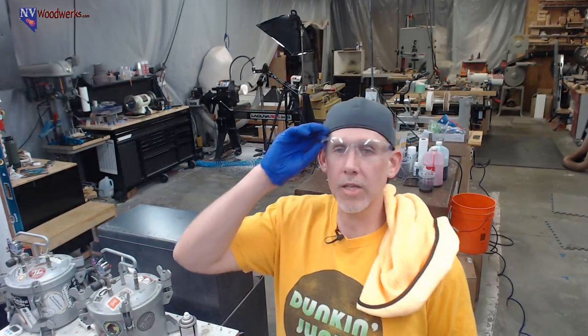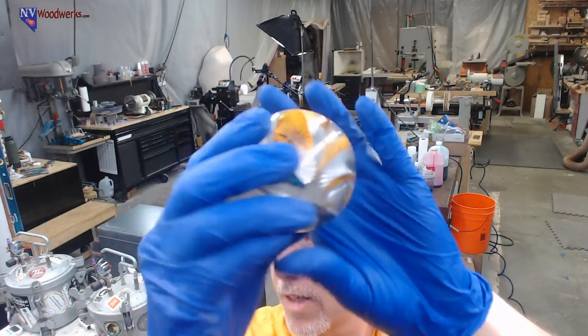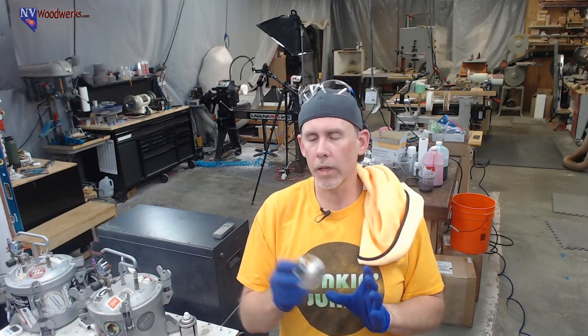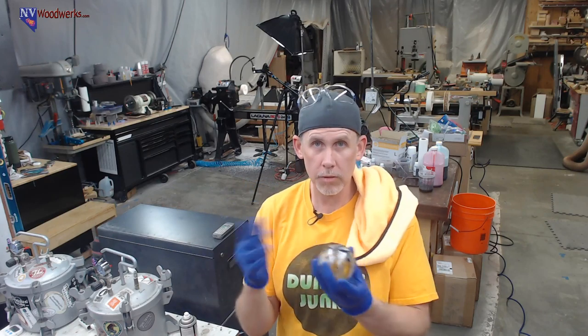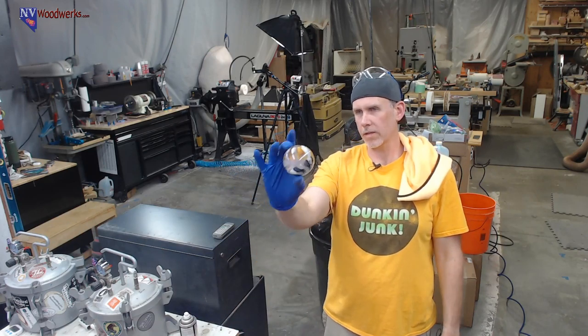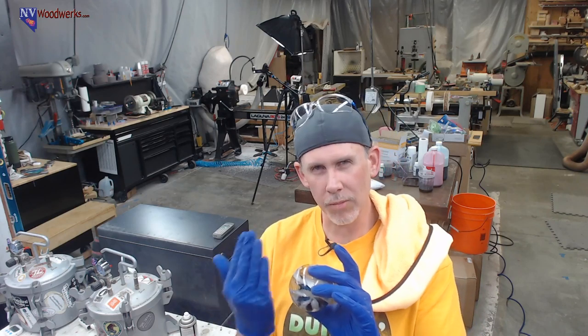All right, so back to the intro cam. What do you guys think? I'm digging this thing. Like I said, and you guys could see, I kind of stopped short, it wasn't dead perfect. You could see a little bit of ghosting. But if I hold it in front of my face, it looks perfect. So don't be afraid while the thing is on your lathe. If it's really wobbling, there's a problem, or if it's way out of shape. But if the thing looks pretty round and there's some ghosting going on, it may not be as bad as it looks.